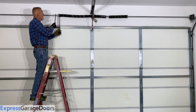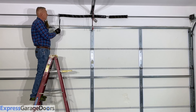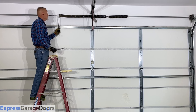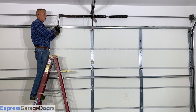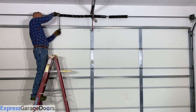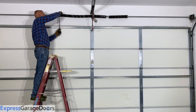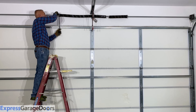You're taking the spring tension off of the tube and putting it on this bar here, resting against the door. All the tension in these springs is on this bar. Make sure your body is out of the path of this bar in case you let it go. Next step: most set screws are 3/8-inch — loosen them by turning counterclockwise. You don't have to take them out, just loosen them and get them off the bar.